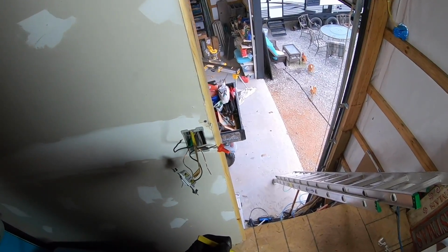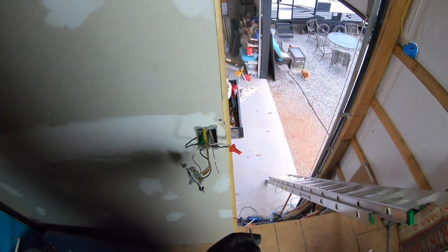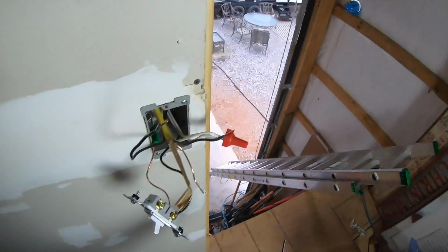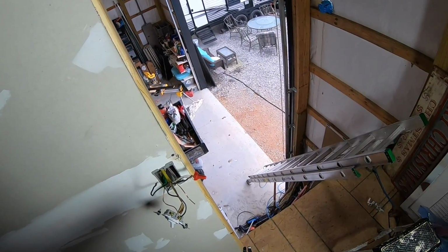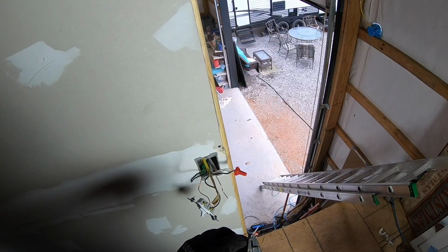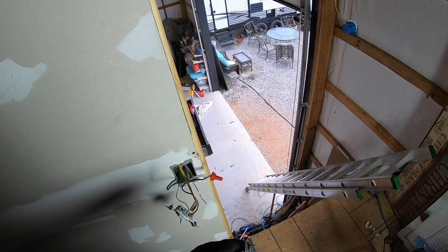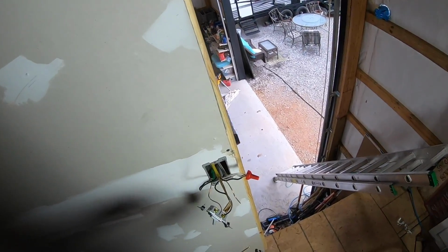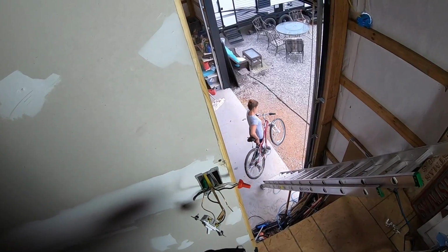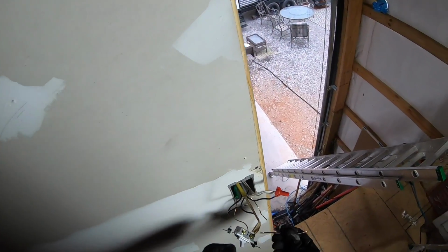So what I'm gonna do is I'm just gonna pull these wires out of the sheathing here. And I just need the one, the black. You can see there's also the white and the common. So I've got this black wire. Just strip the end, each end, to expose the copper. Okay. Actually, one of the ends I'm going to strip a little bit more because I'm going to twist this around the screw here. I'm going to take the end of it and just kind of curl it around to make a U shape. Okay. And that way I can wrap this around that screw like so. Tighten that up. Okay.